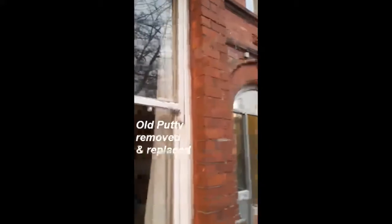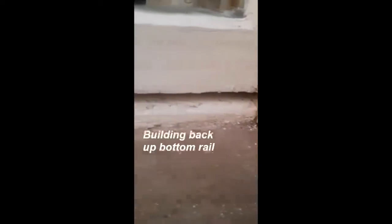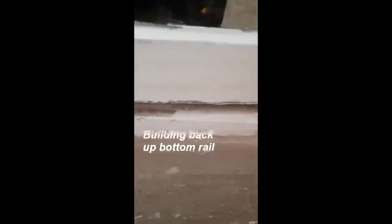And you can see we've got some caulking up there done around the window. We got priming ready to take the putty up there where it's good. We got a little bit of caulk going over the existing to make sure it's waterproof. Started to build up this profile. So we want to diminish that gap, so you can see how far we got.